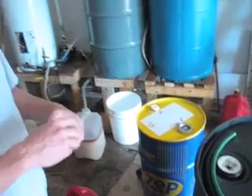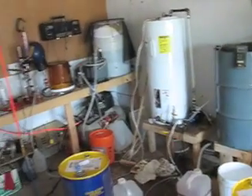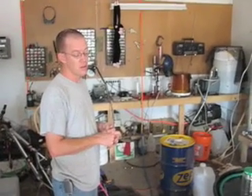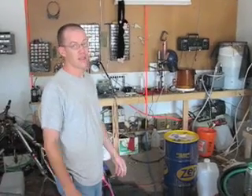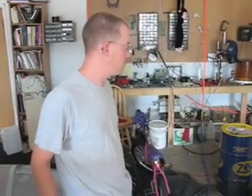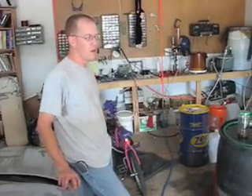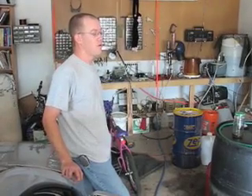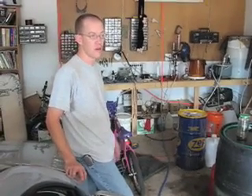That's about 10 gallons of essentially liquid glycerin because it still has a lot of methanol in it. You said you add lye to the methanol to make methoxide — yeah, that makes the methoxide. And where does the lye go? Is it transformed during the catalyzation process? It just dissolves in — it is the catalyst. Not being a chemist, I think that is one of the things consumed in the process. How much lye would you normally add? In a 25 gallon batch of oil it ends up being about 600 to 700 grams of lye — so not a whole lot, about 15 to 18 ounces.